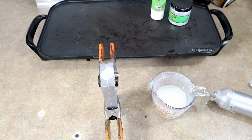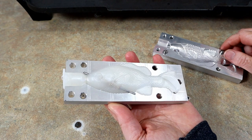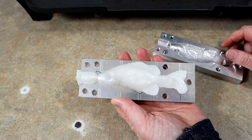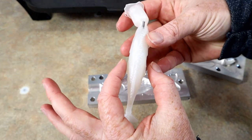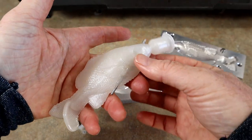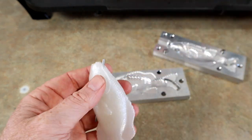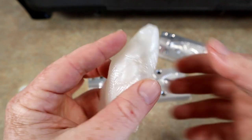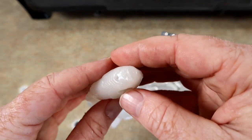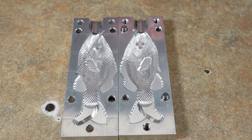There you have it — about five minutes from now we'll be able to demold successfully. Pretty cool — you can kind of see that insert in there. For how much detail there is on this mold, it seems to fill in pretty well. You really have to let it set up before you can demold it because that will just be gooey. You take that rod out and now the weighted insert is still in the front, so the bait has a little bit of weight in it, and you can see that hole goes all the way through for easy line-through rigging.